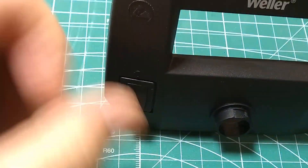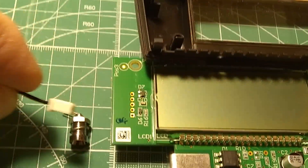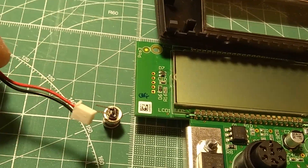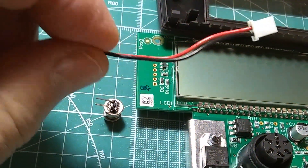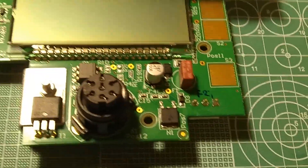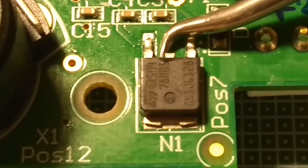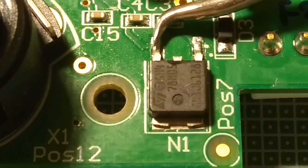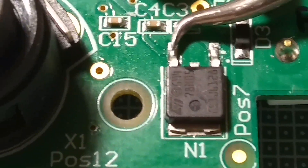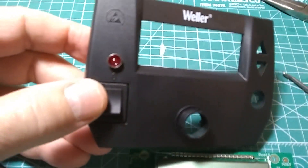I'll mount the LED right here above the switch and drill a hole for it. Instead of soldering directly to the pins, I'm going to use a cable with a little plug. Because it's an LED that runs on 20 milliamps, I'll need a 160 ohm resistor in series on one of the cables. The voltage will be picked up from this voltage regulator chip — the input pin is here, the center is ground, and the output is 5 volts — so I'll connect the cable to these two pads.